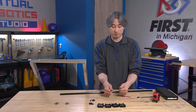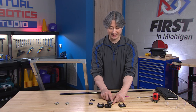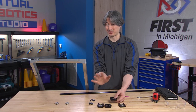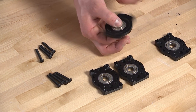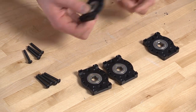So we're good. If you have some trouble pushing it in all the way, you can get a soft mallet and tap on it. It also helps if you get a big socket that fits around the outside edge — not touching the bearing plate — and tap on that as well. With bearings, you want to tap gently; we don't want to damage the bearing. After you've tapped it in, if you give it a spin and it spins freely, you're in good shape. If you feel some bumps or clicks as it's spinning, you might want to swap the bearing out.